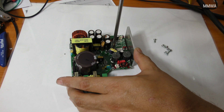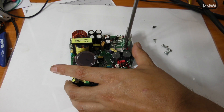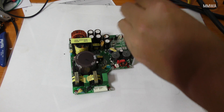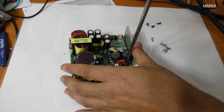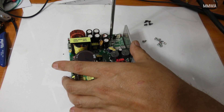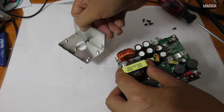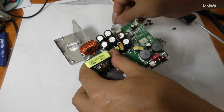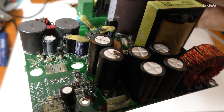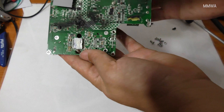To get a better look, we're going to take off the heatsink for the amplifier IC. There are just a few screws surrounding it including the bracket holding it down firmly, and you can see that the explosion event even charred the aluminium heatsink somewhat. Here's a closer look at the corrosion from the leaking capacitors on the top side, and a better look at that crater on the bottom side of the board.